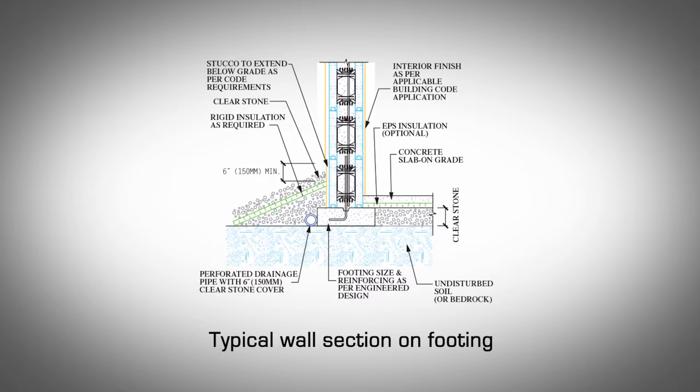First Course Block Set on a Footing: The primary advantage to starting from a footing is that the ICF provides slab edge insulation. The edge of a slab where the floor is located is where the greatest amount of heat loss occurs in the winter. By insulating this area, heat loss is minimized and homeowners experience cost savings.